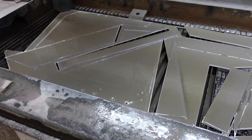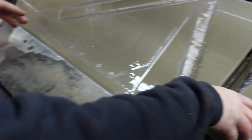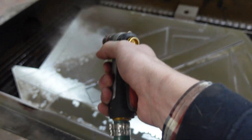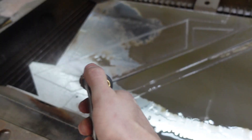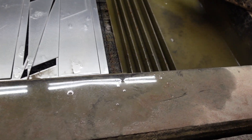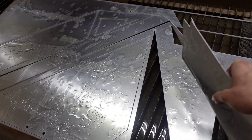Oh no. I see a handful of them that look good. The zero was off a little bit. There shouldn't be like a half inch on that — there should be a quarter inch gap here. The sheet had to have shifted somehow, maybe when it lifted and we put it back down.